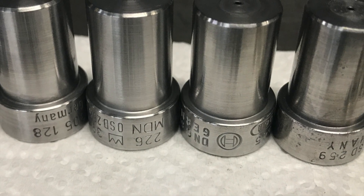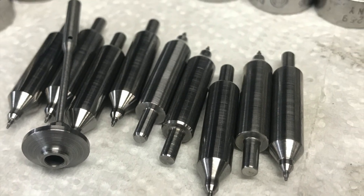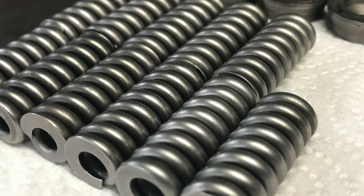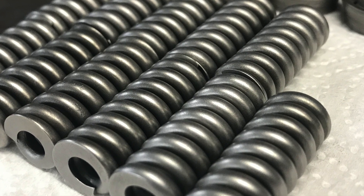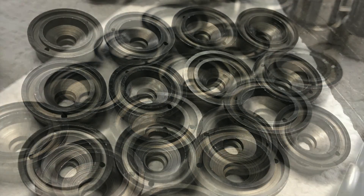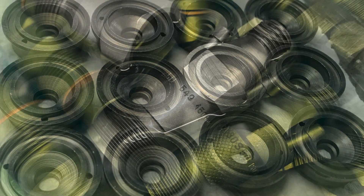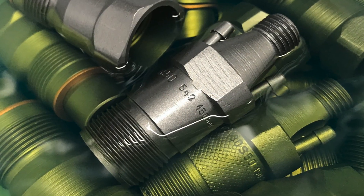Some of these injectors have already been gone through — you'll notice there are different brands for the nozzles and various imperfections: nicks and things I'm trying to sand down and clean up, bits of cavitation and eaten-up areas within the bodies and around the springs. I'm trying to be as nuanced and nitpicky as possible, looking for the best of what I've got.